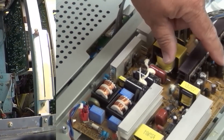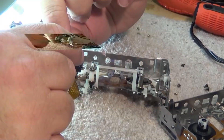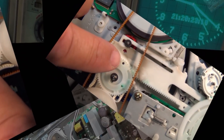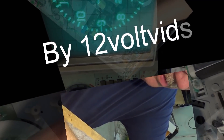I'm going to put on my electrician's hat today and see why I've lost half the power in my detached garage. There's a 240 volt circuit. I've got a 15 amp circuit upstairs and a 15 amp circuit downstairs plus 240 for the heat. This was pre-existing when I bought the house, and when you open this thing up it's actually quite a disaster in there. I don't know who wired this but it certainly isn't to code.